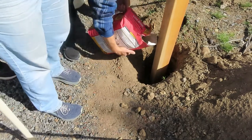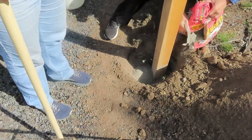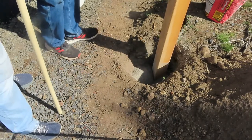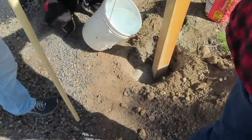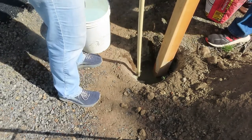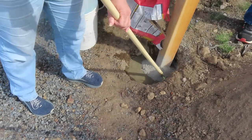We poured in the cement — it's a substitute for fence post cement. We put it on both the uphill and downhill sides. Next is adding water. We need to keep this straight and level while doing this — it was leaning, so we corrected it. The goal is to get cement all the way around the post, not just on one side.